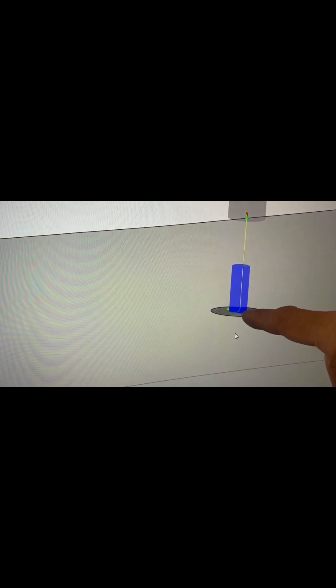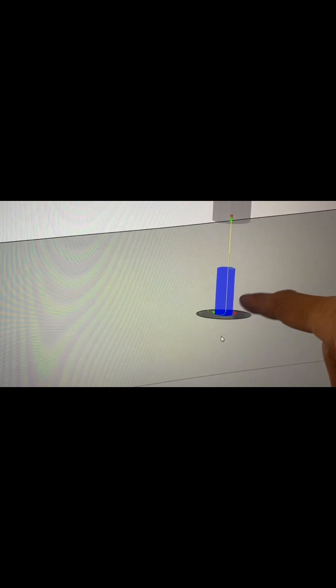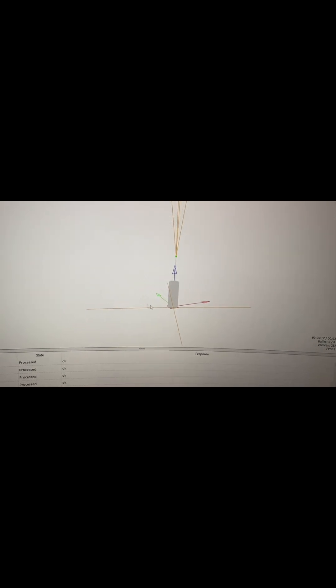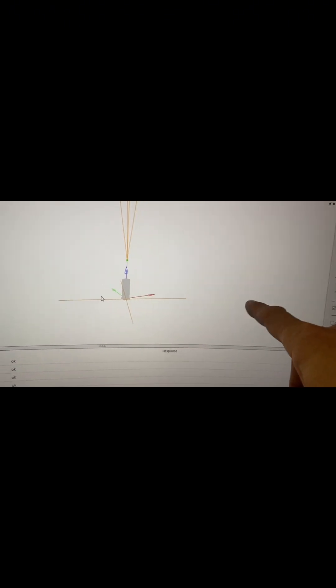It's going to take about four minutes to come down seven millimeters, but it won't cause any strain on the model since the model is only double-sided sticky-taped to the mill surface. Now all I have to do is set the height for each hole, double-check it's set right, zero that height, then move the bit to the top of the pin and use my finger to feel that it's centered in X and Y. Then I hit the origin center, move the height down and zero it using that command, lift it up above, screw it over the top of the pin by hand, set the XY coordinates home, and hit run. The program just orbits down on top of the pin until it hits the zero height and stops.